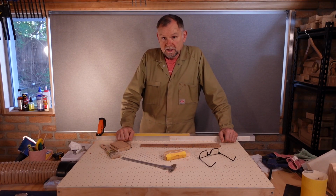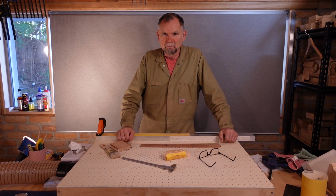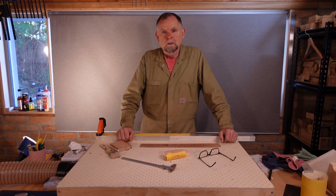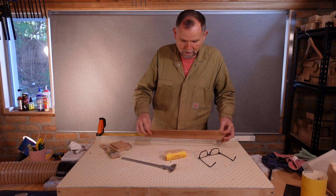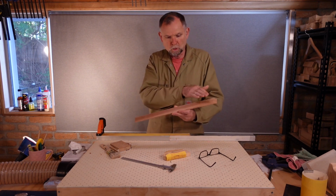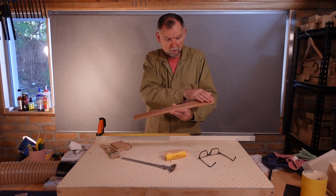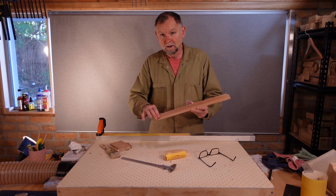I fear that my satisfaction with how I adjusted the neck angle by sanding on the body rather than the face of the heel may have been premature. When I went to calculate the height of the bridge, it came up woefully short. I've just spent an hour sanding a perfect wedge off the bottom of the fretboard, nothing at the body end, perfect straight line down to a millimetre off at the nut.